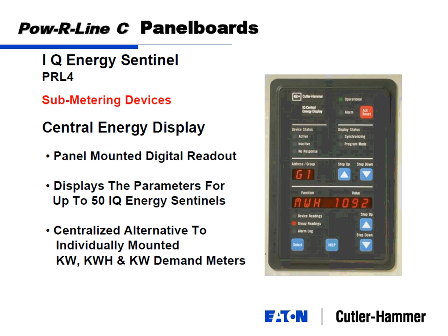CTs, same theory, but rather than a CT disconnect, we'll wire these into a shorting block. And the shorting block allows you to dial a couple screws in to basically isolate this from the meter. So then this will be your meter here with voltage inputs and current inputs. And all this is built into the meter.